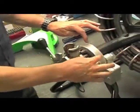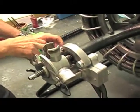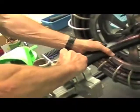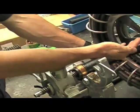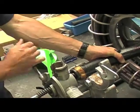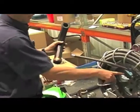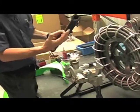Right, to the bronze bearing now. This is called the Torque Tube, and this is called the Swing Arm. To remove the Swing Arm, there's a little pin in here. Be careful when you do this, because this is all spring-loaded. So you just push the spring in, lift it up, but have one hand on there, because with the spring tension here, it can flick up and try to get you. Lift that up, push your cable through, just like that, and that's your Torque Tube. You can just click it in there so it doesn't come out and potentially hit you in the head.